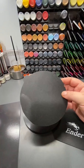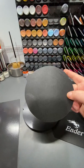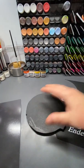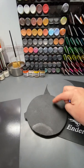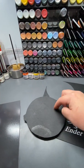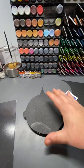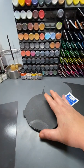Clean the back of your removable flexible build surface with alcohol as well. Once both pieces are dry, line up your little notches and put it together. Go back over with a fresh alcohol wipe and scrub everything down — oils from your hands will affect how well the magnetic pieces adhere and how well the filament sticks to the build surface. You want it completely clean: no dust, no oils, nothing.